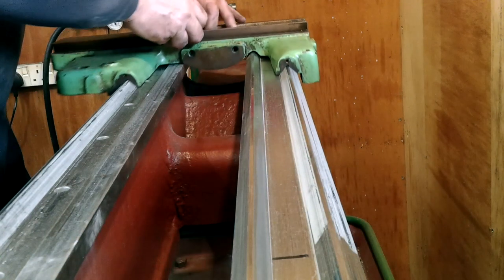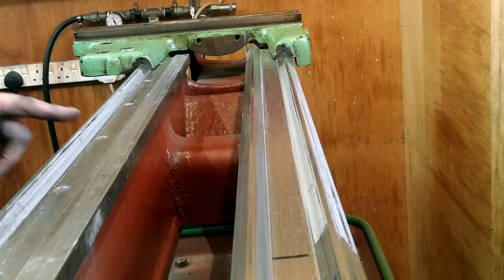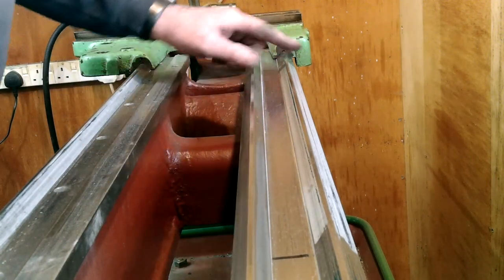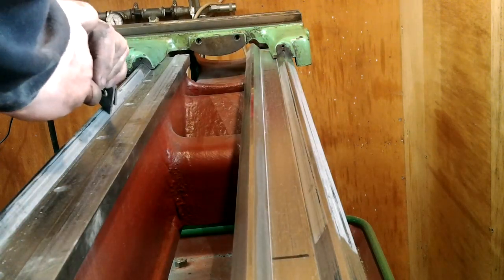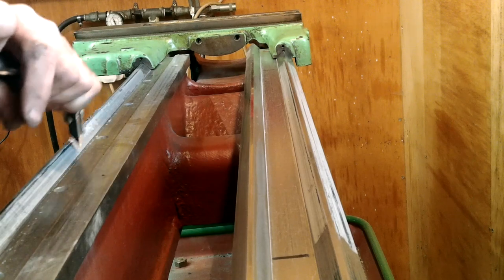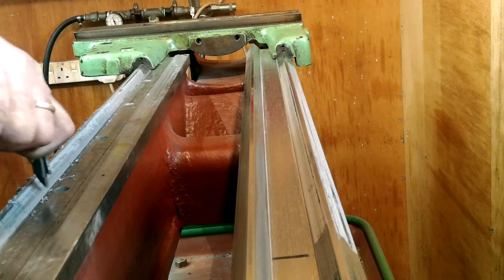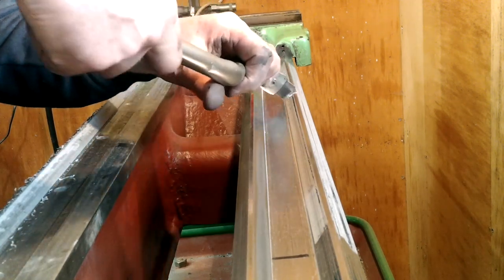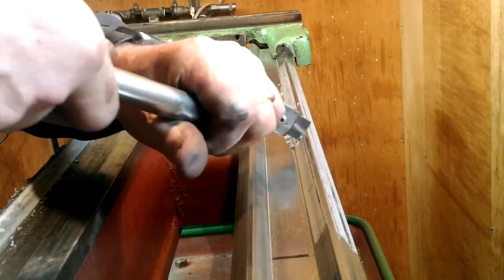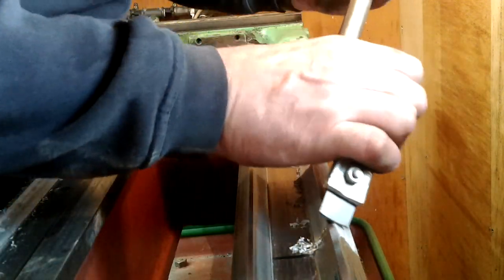I couldn't resist putting the saddle on at this stage just to see how things were shaping up. Surprisingly enough, it wasn't too bad. The nearest slide to me wasn't showing much contact, mainly because the two inside slides were in need of a little bit of attention. However, after a slight adjustment to the inside faces, all four faces showed a positive contact.